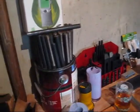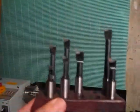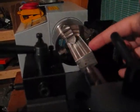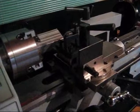There's a lot better clearance on those, so we're going to make a little boring bar holder. All of them have a half inch shank. Once we get a boring bar holder, we'll be able to put that into the lathe and use it for turning a bore. I've got a square block - this is just aluminum. I find it's so much easier to work with in the four-jaw. I've made a mark roughly where I want the center of the boring bar.